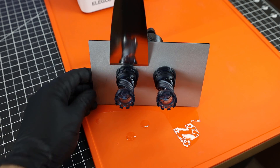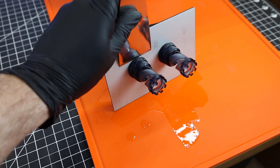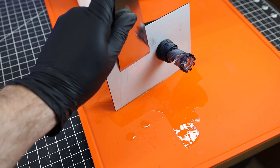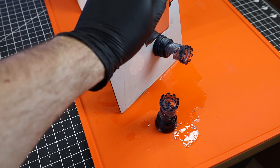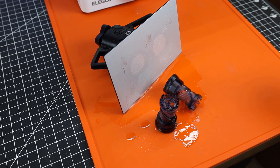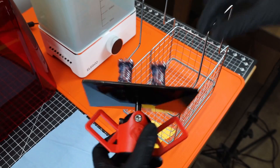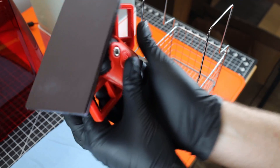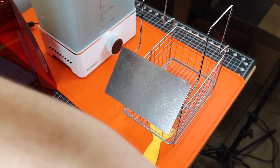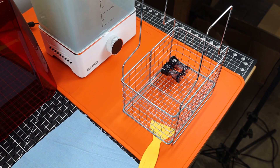Now with them all clean, I have to get them off of the build plate. I'm going to be using a sharpened metal scraper and a rawhide hammer. There are some downsides to doing this — you're scratching the build plate a little bit, hitting it with a hammer will put it out of level eventually, and with smaller parts they tend to go flying. This is the reason why I like to use the magnetic build surfaces. Here's an example: I installed the magnetic build plate, reprinted the parts using the same file, and all I need to do is remove the spring steel sheet, put the build plate back on the machine, and then flex the sheet — everything falls off into the cleaning basket. That's probably the quickest way I can show why I like these so much.